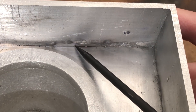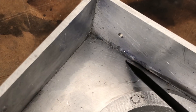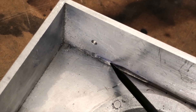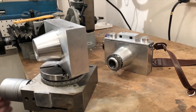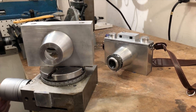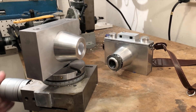On the inside, there's a lot of what looks to be blowout and wall thinning, which is from poor heat control. Seeing as it's on the walls and not so much on the front part, I think changing the angle of my torch and focusing more heat onto the large front plate could minimize this and also lead to stronger welds. But even with all these errors, the completion of this part marks a big milestone in my skills. I'll be pulling the welder out several more times before the end of this project and I'm excited to see my welds get better and better. But for now, I'm calling this part finished.